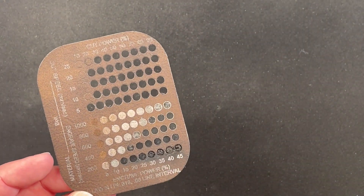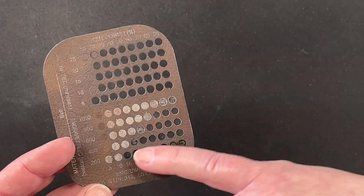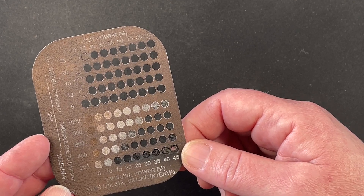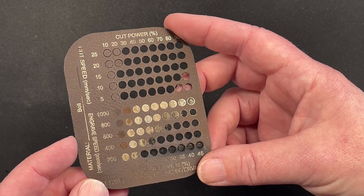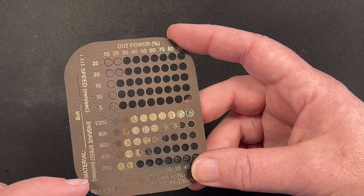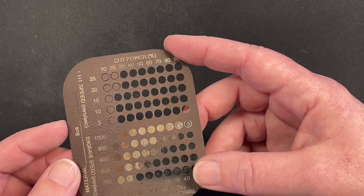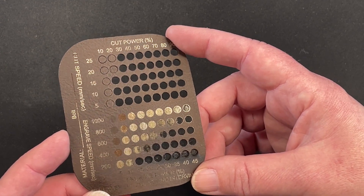Going back to some of the dreaded metallics — this is brown and silver. It's OK, but this definitely needs some more tweaking to figure out, do we need to defocus? What do we need to do to get optimal results for this material? Now we have the brown and gold, and it did OK — again, not as good as the blue and silver. Definitely needs some tweaking where it was engraving some of the words. Maybe it wasn't perfectly flat, or maybe this particular color needs a defocus or something.